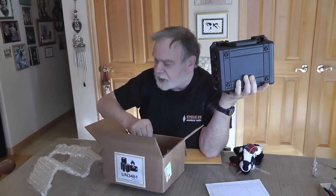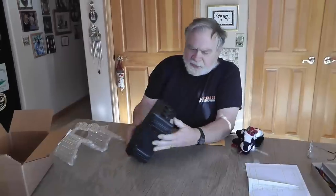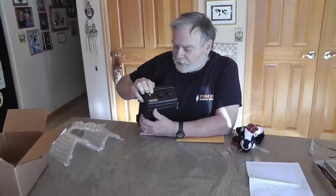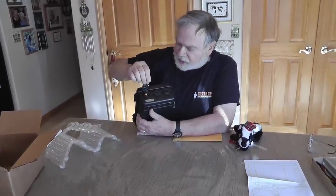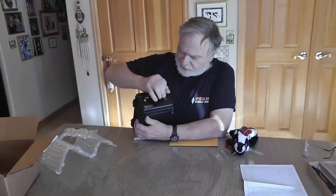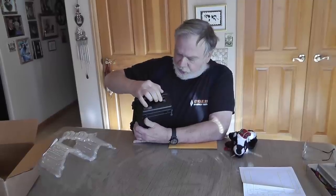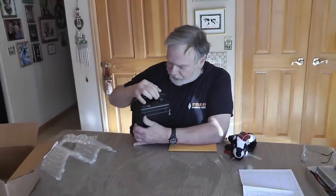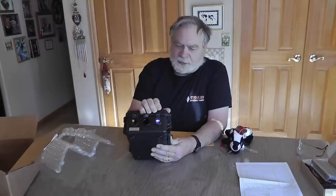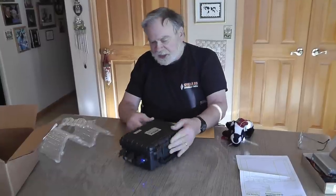This is in a GOBOX style. The yellow connector is solar in. The red is DC out, nominally 12 volts, actually closer to 13. This one right here is a classic cigarette lighter or power takeoff port. And this one is a USB 3.0 charger and PD — which includes a USB-C port. It's reading 13.1 volts right now.